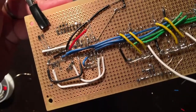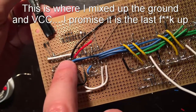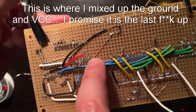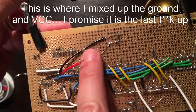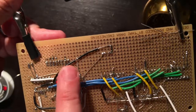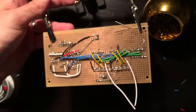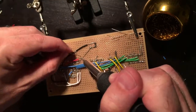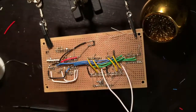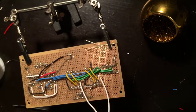Okay, so what I've done there is I've wired up this ground to this ground, bridged it to the enable pin, bridged it to this enable pin because they both enable lows, or active lows, to ground, took the 5 volt to 5 volt, I'm going to tie that one to that one, and then we're going to have those chips done. Okay, let's pull the selector 5 volts, which is this pin, and their enable low as well.